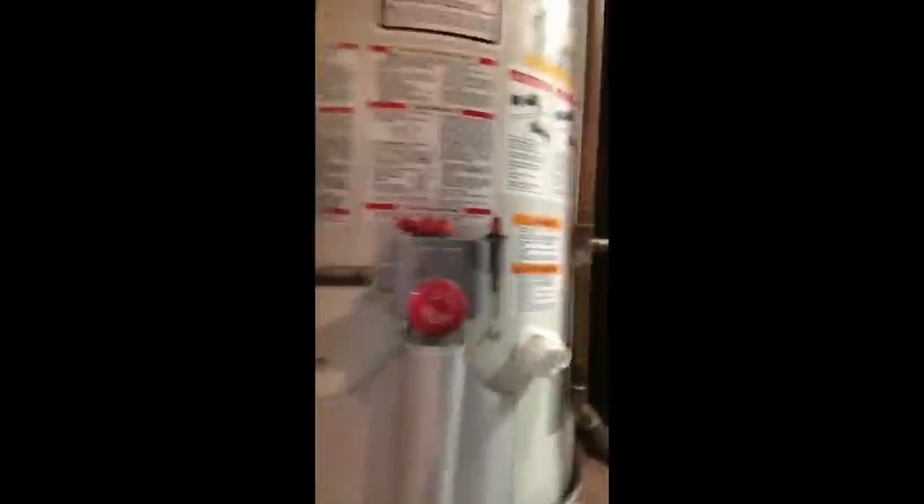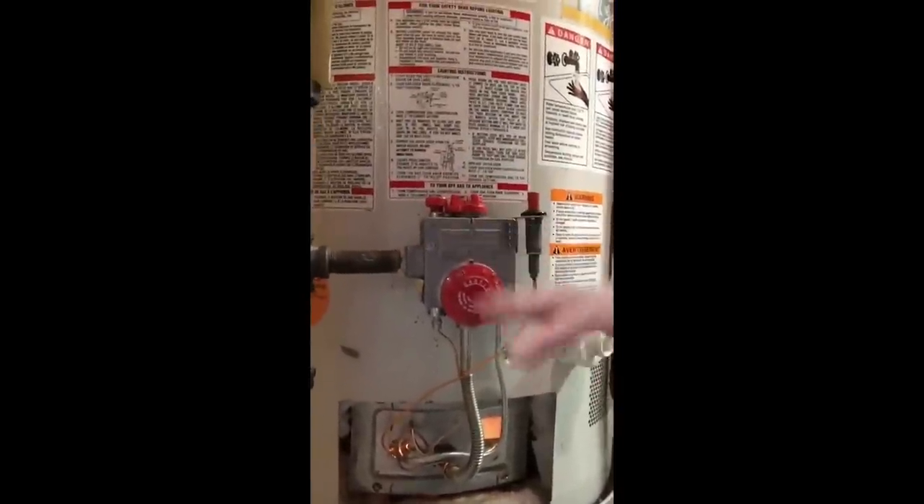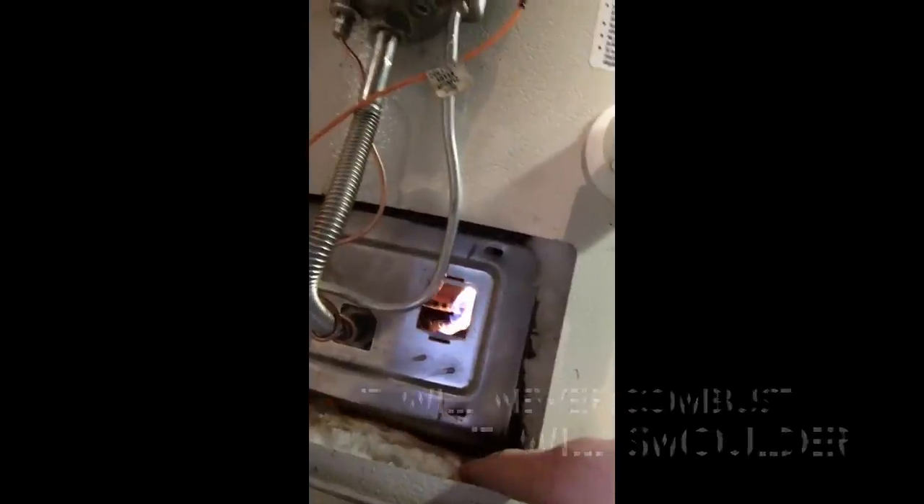So here is my temporary solution. Here you have your cover — comes off like this. I replaced the pilot line, the thermocouple, the striker — checked all this out, everything's fine in here. It's not getting enough air. So I took the window off here and the door is actually open. Now this insulation that comes around these things won't combust unless you're somewhere in the neighborhood of 250-300 degrees C, so it's really unlikely that anything's going to catch fire there. That said, it's not the way it's built to go together. However, if you don't have a thousand dollars to spend on a hot water tank on a Tuesday, this will certainly get you through for a few days.